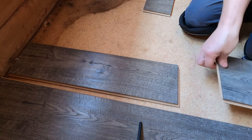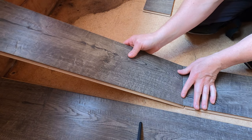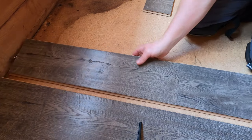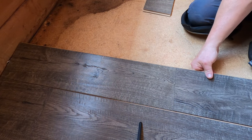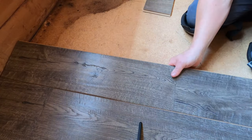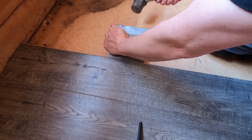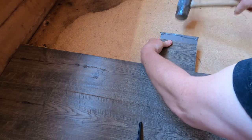I'm going to take you guys on one row with me. We start with this piece — make sure that's down good. I'm going to connect these two up and make one longer piece, so listen close — you can hear it pop just a little bit as it goes in. We're going to make sure I've got about a quarter of an inch away from the wall, line this up, get everything pushed in, and then use this block to pound that down. We want to make sure this seam gets hit at the same time so those seams line up.